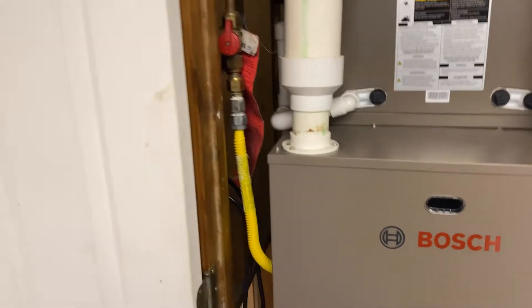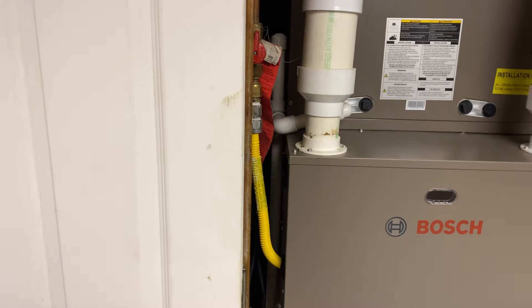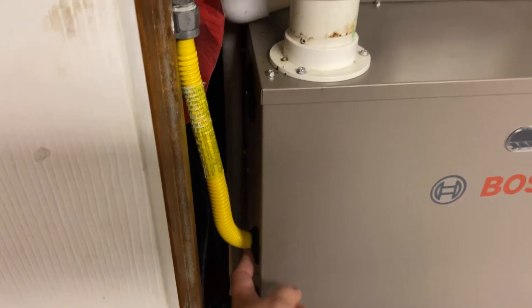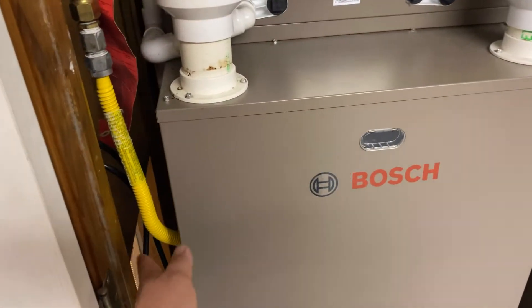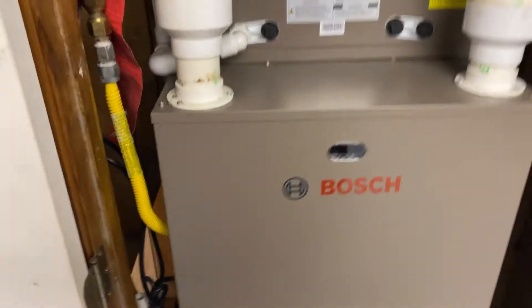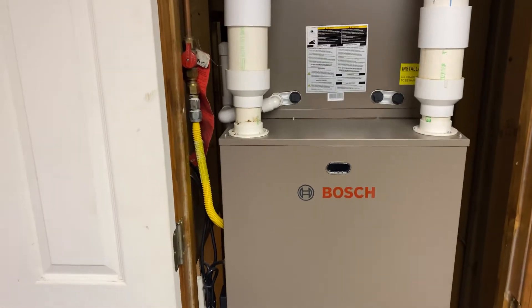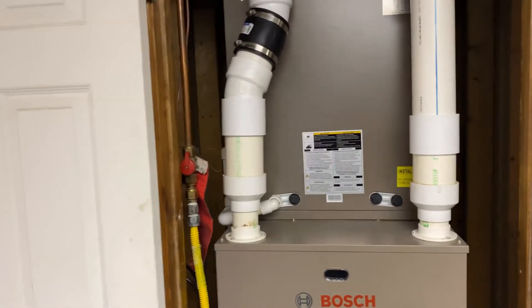The only thing I know I'm going to hear flack about - and I understand, I don't really like it that much either - is the gas line. You're usually supposed to hard-pipe it inside coming off the gas valve, and then you can tie a flex on to that. I don't like it, but I'm not going to change it and I'm not really worried about it since there are thousands like this out there. I didn't do the install though - some of our really good installers did.